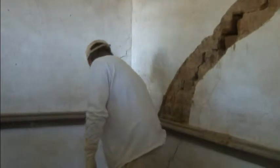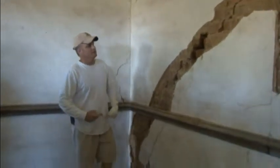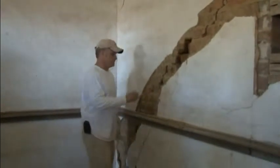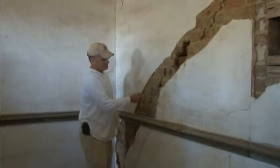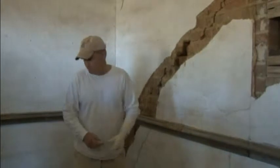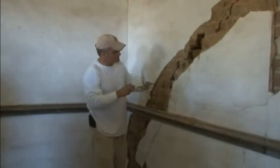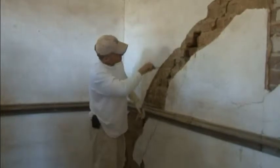After you've exposed it, you can start the prep work — basically just removing any loose mortar to start with. Something like this obviously has to go. There are a number of tools you can use. One of my favorites is this — it's just a drill bit with a handle on it. I like it because you can get far back in there, deep into the wall, and that will help clean it out. So you want to get all that loose material out.